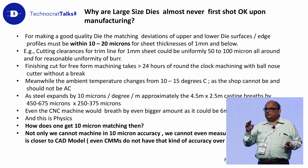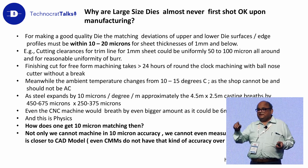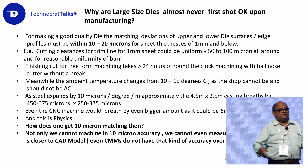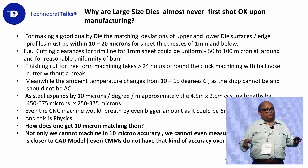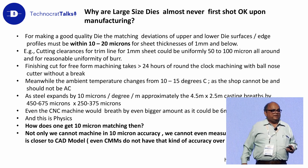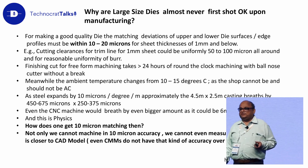You can do one test on your CNC machine: put a dial so the coordinate readings shown are the same, and take readings after every one hour for 24 hours. You will see your machine is also breathing by 0.4 to 0.5 mm. So if your job is breathing and your machine is breathing by 0.4 to 0.5 mm, how can you get 10 to 20 micron matching? You can't — not only in machining, you cannot get matching even in inspection with that precision.